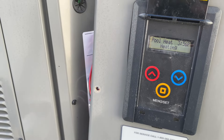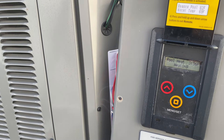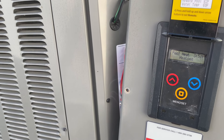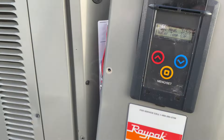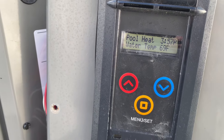Right now I'm starting to hear a slight noise in the background — that sound you get on an outdoor unit when it's low on refrigerant. I hope that's not the case, but we are still running — it's been running for a good two minutes or so right now. We're going to keep an eye on this.